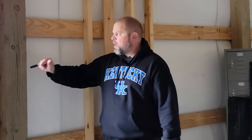We have to have that box sticking out 3/4 of an inch past this post, because if we ever finish these walls, we're gonna put that metal on these walls, right? Now when we come in, if we ever put a wall in here, it'll butt up to about right there, give us 3/4 of an inch. And when we put that metal right here on it, you can see that little bump, it'll fit right against the panel door right there, so to have a flush fit for that. So I'm just kind of planning for the future on that.